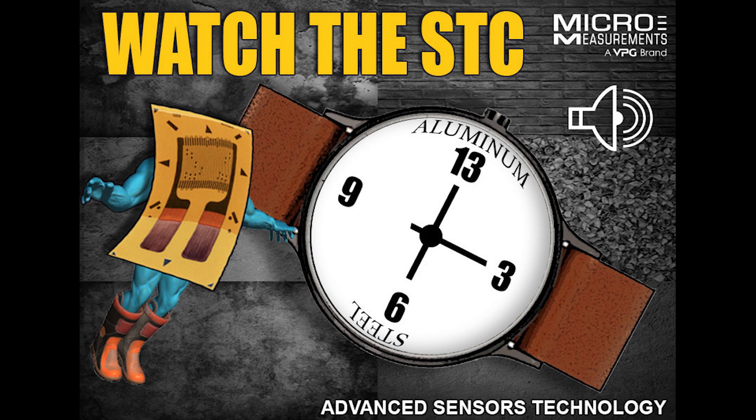Yes, 00 STC for a carbon fiber material is a good starting point. Now the discussion came up about the data that we provide with the strain gauges relative to the STC value. If I remember correctly, if you have a 00 compensated gauge, the reference material we use is titanium silicate. That's correct — titanium silicate, TSB1 if you want to buy it from us, has an almost zero coefficient of thermal expansion, very similar to that of carbon fiber.